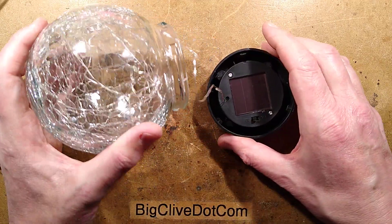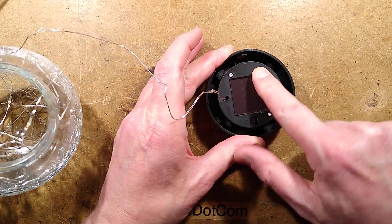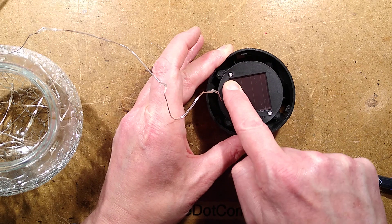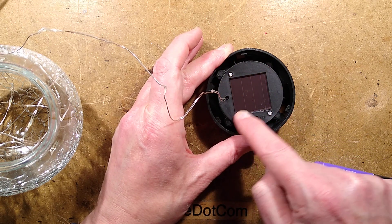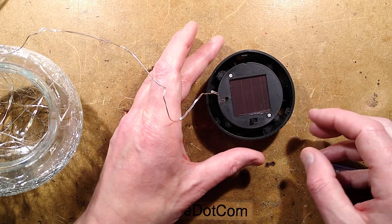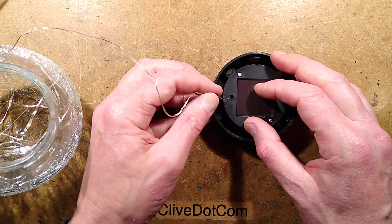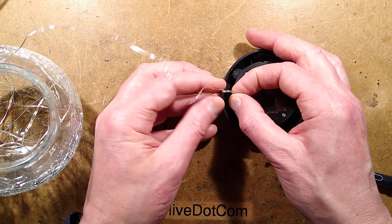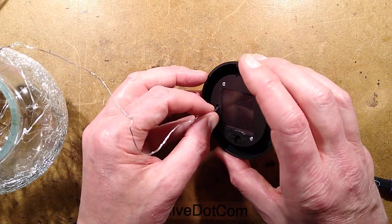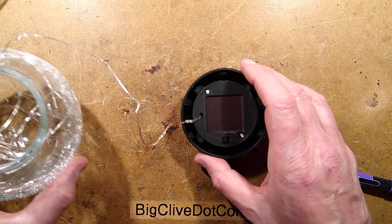Watch your eyes — the light's coming back. You could also go to town with Vaseline and push it down the side of the solar panel, so there's much less chance of water getting in because it's already full. There are so many things you can do to make these last better, and they're completely hackable. You could add a little connector — smother it in grease, because if you don't it will corrode.